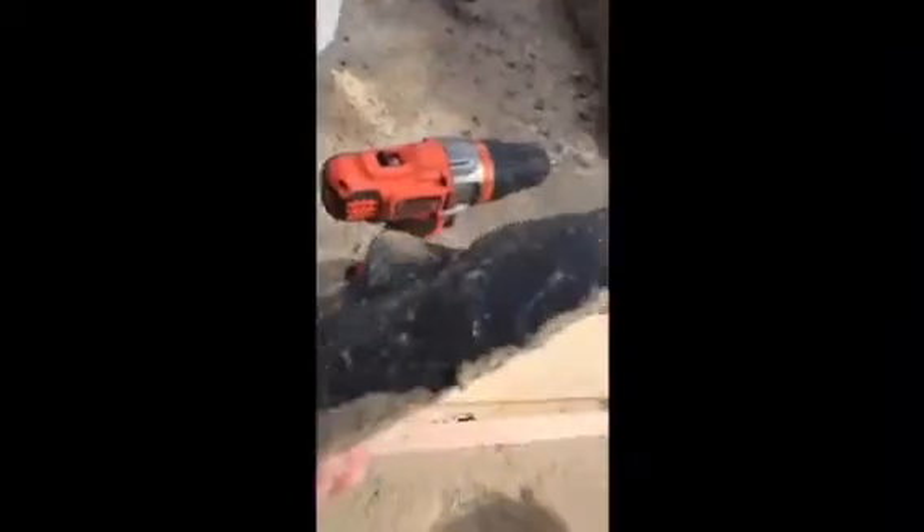Just removed the face from the mold. It took off some sand on the side — that's probably because of the frillies that were still on the mask, since those edges were a little bit higher than the rest of it. But overall it came out okay, and that's not a huge deal since I can file pieces like that off or repair with a little bit of sand.